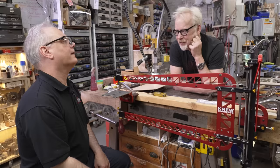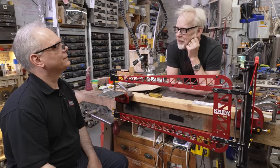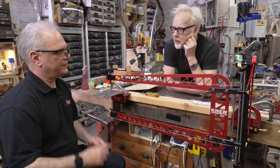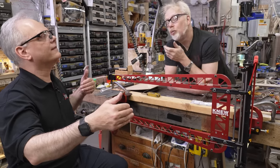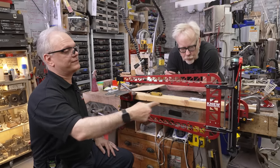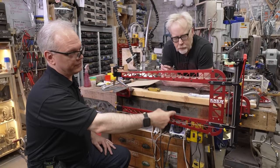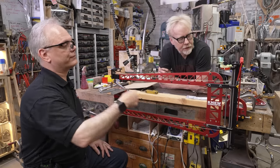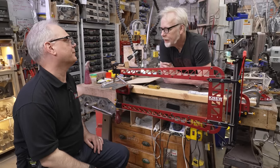It's the exact same number of balls, and there's no timing. It's lighter than any kind of timing chain. I was thinking about a timing belt, but timing belts you have to get them in specific lengths. And this thing is modular — it changes sizes. There are three different sets of legs for it: this is 24, it can be 18, it can be 12. So there are three different sets of chains and it was just not worth fussing with timing belts.